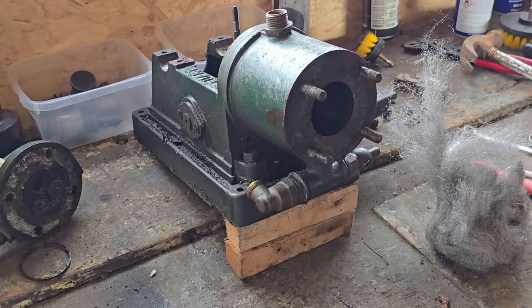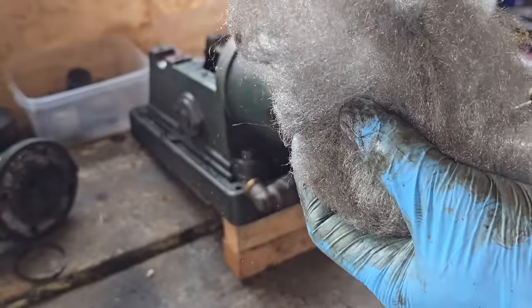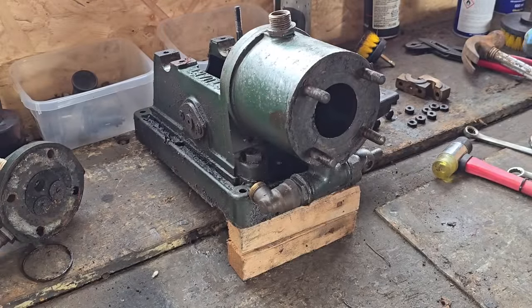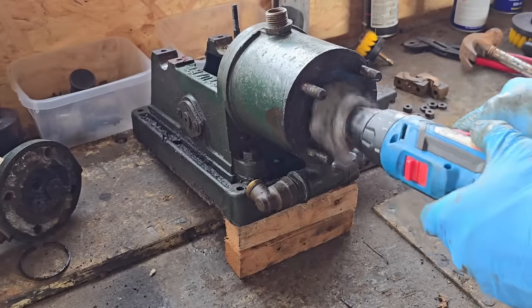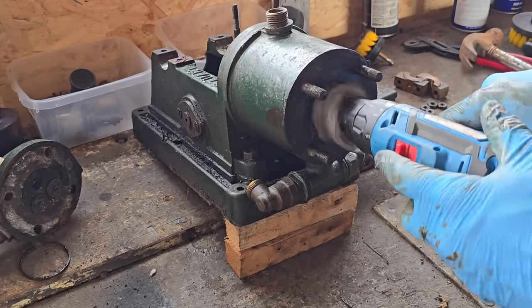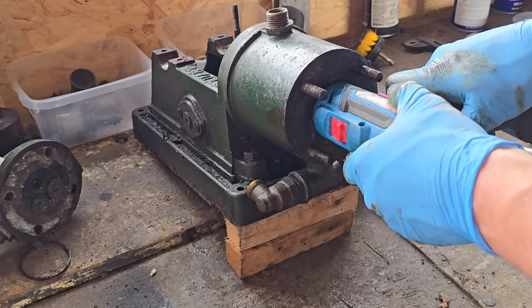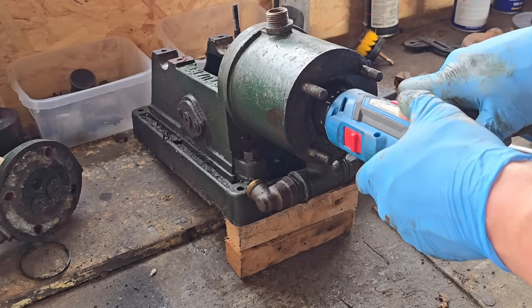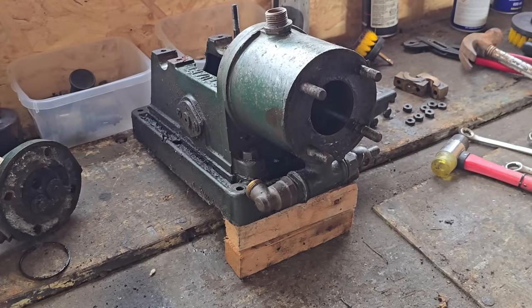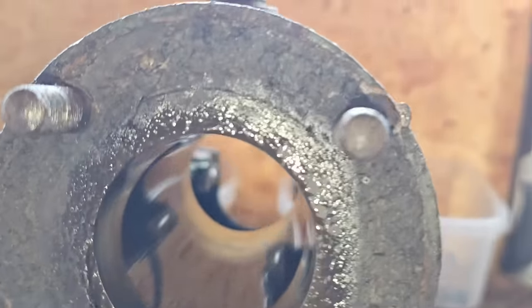So guys, this is going to make you laugh. We've got a bolt in a drill. Put your bolt in your bit of wire wool and turn the drill — there you go, that's wrapped around. Now we want to lubricate this cylinder with some WD, chuck him in here — and there you go. Let's get some speed — and this will just clean that cylinder out. Is this any good if you've actually got to hone a cylinder? No. But it's perfectly alright just to clean one. Look in there — our cylinder is shiny. Look at that.